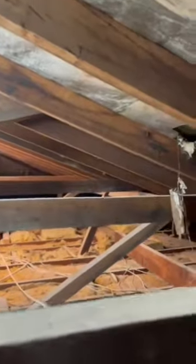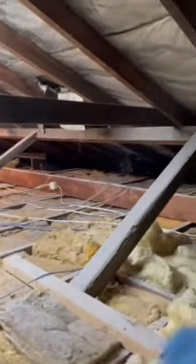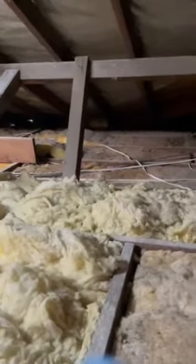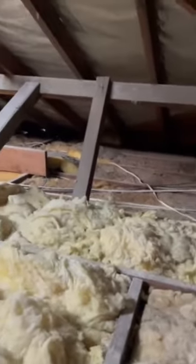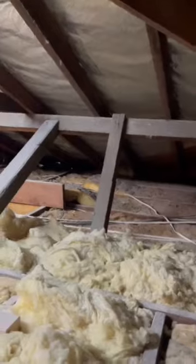That's from my experience — something you can keep an eye on if you do have an older property. So the main things are: check top plates on bathrooms, laundries, and kitchens; check the structure of the roof; start on one corner and check for any termite workings or termite leads. One important thing — if you do find anything that looks like termites or termite leads, please don't open up the lead or break it open. That's the worst thing you could do unless you're an expert. An expert will open it to identify what kind of termites they are, because different species require different treatments — coptotermes acinaciformis, coptotermes frenchi, nasutitermes, schedorhinotermes — they all have different treatment processes.